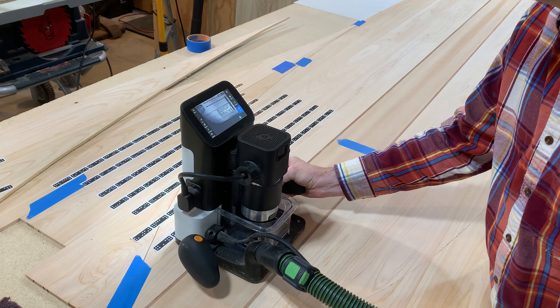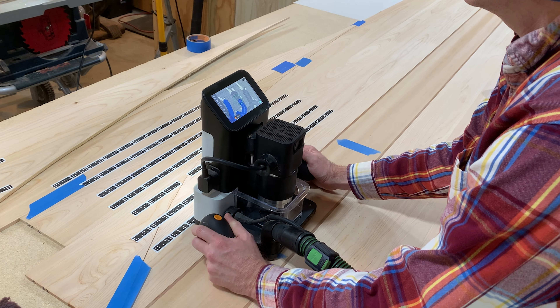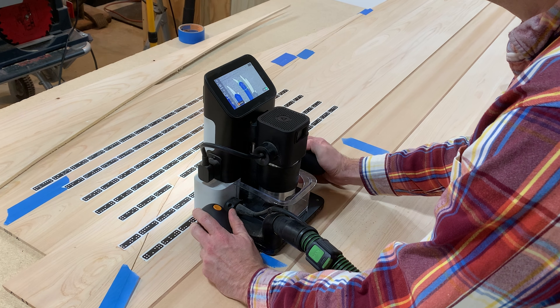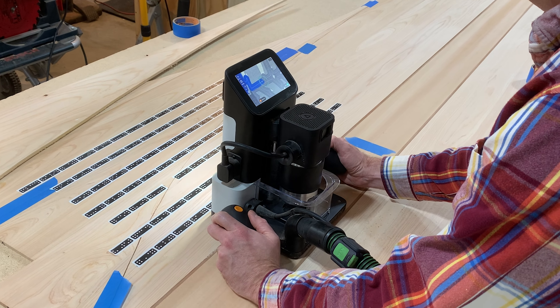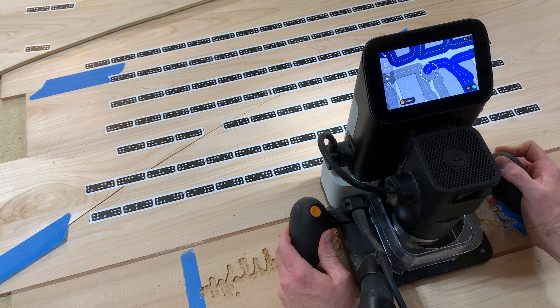That shows me in space where my drawing is. I cut the first section with a quarter-inch bit, doing all the rough work, because it's the biggest bit I have. Then I step down to an eighth-inch bit, and eventually a sixteenth-inch bit, and each time I clean out any wood I haven't hit on the previous passes, because I can go into more detail with each smaller bit. There's the eighth-inch bit — see how it's missing those tips a little bit? You kind of clean it all up with each smaller bit. Then I put in the sixteenth-inch bit, and if you look at the toolpath — the dotted line — it really goes into every little corner, only doing just the tips, so I'm not cutting through a lot of wood with that sixteenth-inch bit. Just doing detail work.